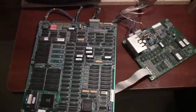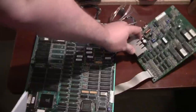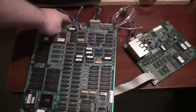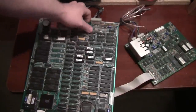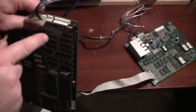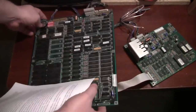The soundboard also requires a 50K ohm variable potentiometer for volume control. It goes to pins two and four of P5 on the soundboard. As for the connections for low punch and low kick — when the board is installed in a machine, high punch, block, and high kick are controlled through the JAMA harness at the edge connector. Low punch and low kick are what's called JAMA Plus because those wires aren't normally included in a standard JAMA connection. On a Y-Unit it hooks to P12, which is a 12-pin connector. On a T-Unit it's a 15-pin connector, so if you want to put a T-Unit board in a Y-Unit machine you'll need a different low kick/low punch harness, and the pinouts are different between Y-Unit and T-Unit.